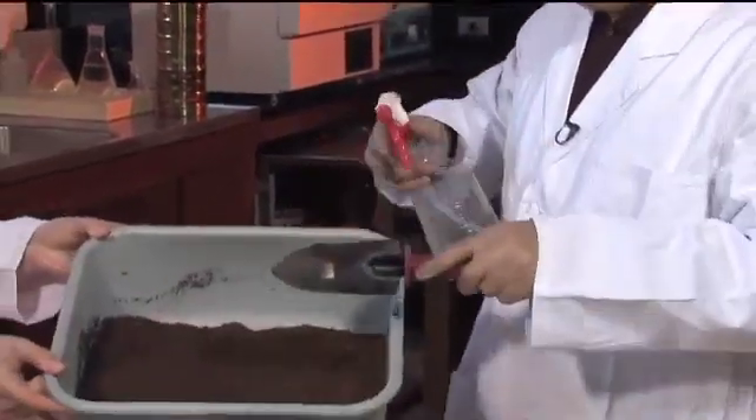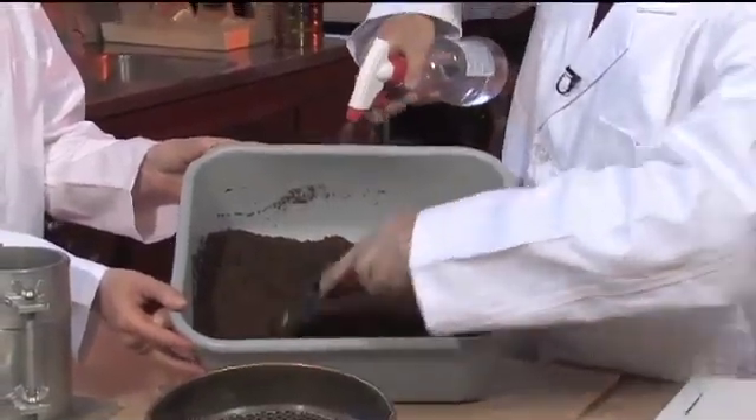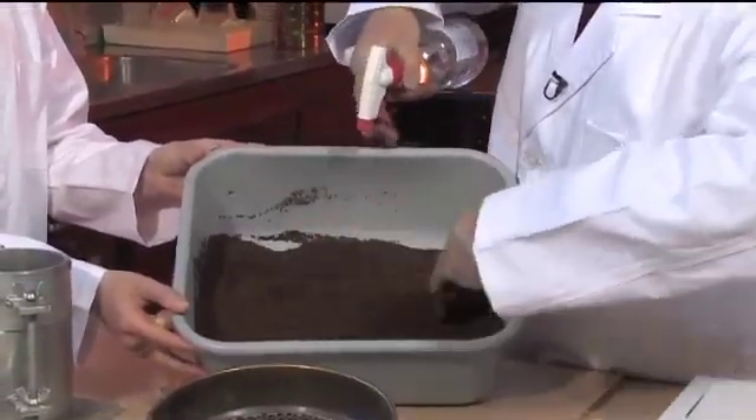To reach that midpoint, you add water to your sample and then test if you can form a ribbon. If you can form a ribbon, that is the point for your midpoint water content. It sounds like it just takes a little bit of experience to know when the soil is going to be able to form a ribbon.